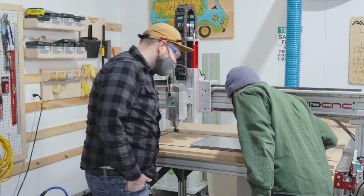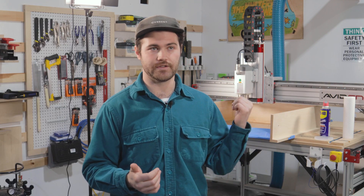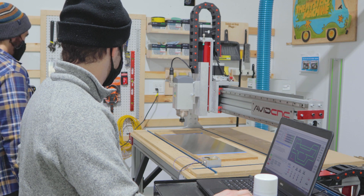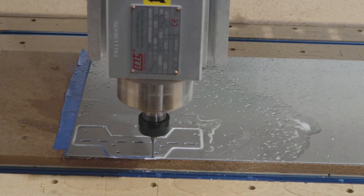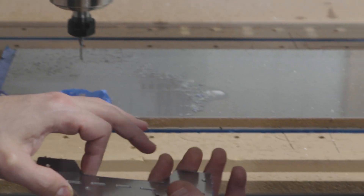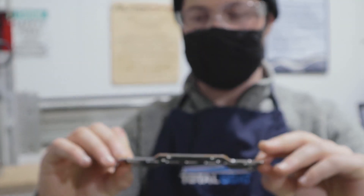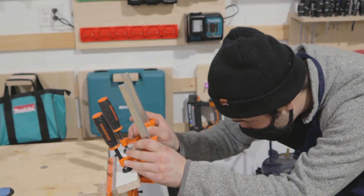I was feeling really good about it, but the cuts weren't great — there were burrs. The whole process of machining aluminum on this machine, we've never done it before and this machine's never cut it before, so we were kind of in the dark on all of it. We jumped straight to an eighth-inch bit — it's a lot more robust, single flute, and it could take all those chips away. So we've got some CNC aluminum for you — it's so light, it's crazy.